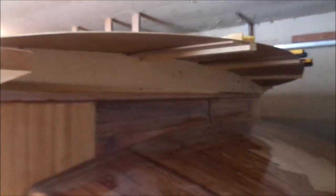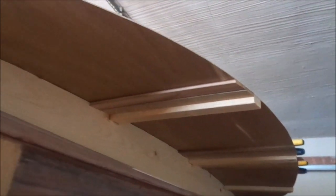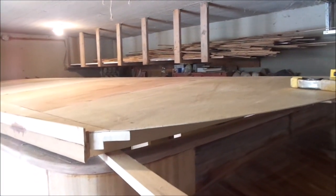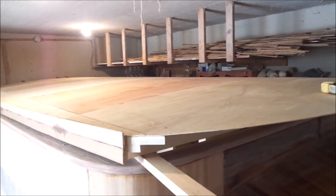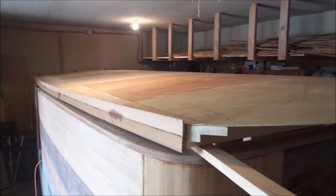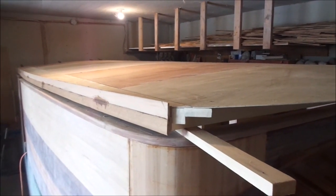Around the front of the canopy I've trimmed that, and I've also started adding some cedar underneath — just gluing it on. I'm going to put cedar slats all the way across the bow underneath, and then I'll have to prep this for glassing. I won't be able to start glassing probably for a couple of weeks unless we get a warm spell — right now it's 4.4 degrees Celsius in the garage.